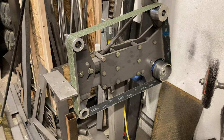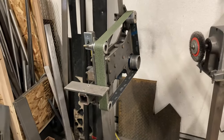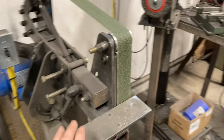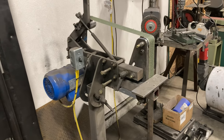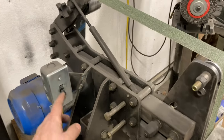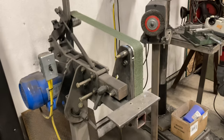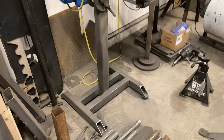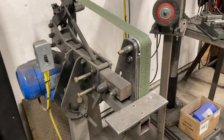And I built a homemade 2x72 belt grinder. Kind of like a lot of my tools — they get built just enough to work but never quite finished. I still need to build some other attachments for this, but that thing works pretty awesome. It's got a 2 horsepower motor and just fixed one speed — just on/off. So far it's been good. Runs real true, doesn't vibrate. I built a real sturdy base with rubber feet.